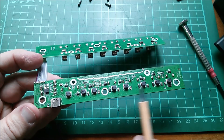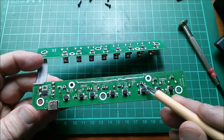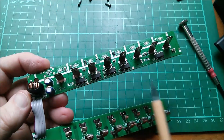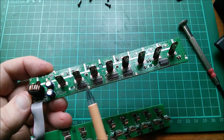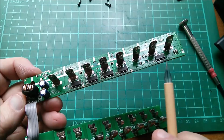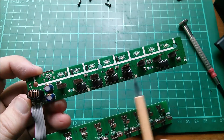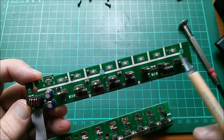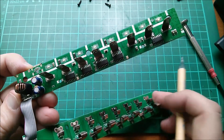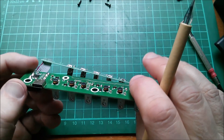On the main board there are eight inductors, and really only one other active device besides diodes, so I'm not sure whether that constitutes an individual buck converter per channel — we'll have to look at those. On the top side there are several 16-pin ICs, but they all have no markings on them — there's another 16-pin IC as well. So five ICs total — maybe one is a controller and the others are purpose-built dual-channel charger chips. There's a big inductor wrapped in heat shrink, a couple of capacitors including an electrolytic.